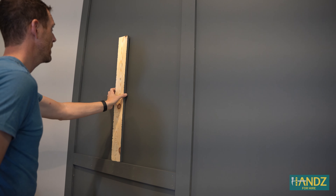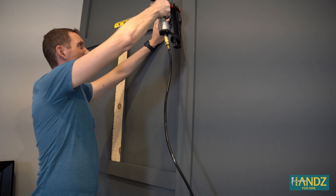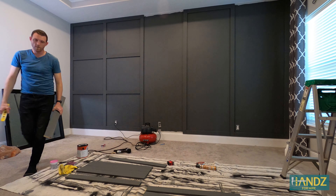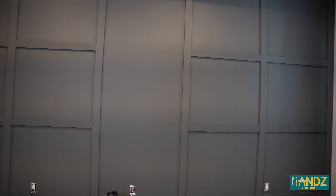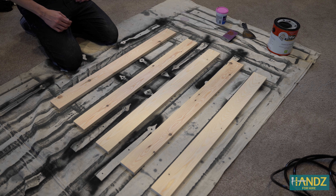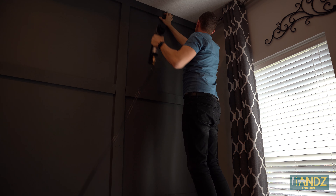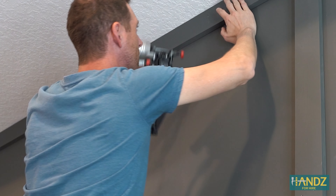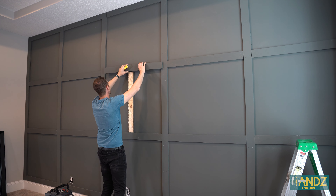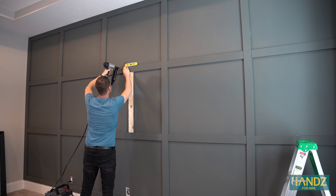The wall is not flat. It's time to start on the grid pattern. What I did is take a piece of scrap wood and cut a 33-inch board that I can just stick right here — that'll give me the perfect spacing. Then I take my board and rest it right on the 33 inches, take my level and adjust as needed. That'll be an easy way to attach the horizontal boards and I'll have a perfect 33 inches each time.